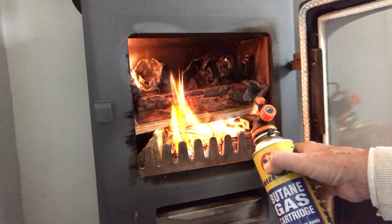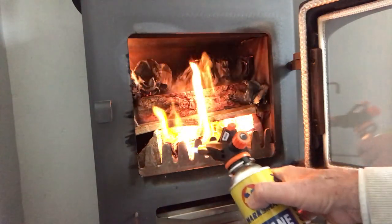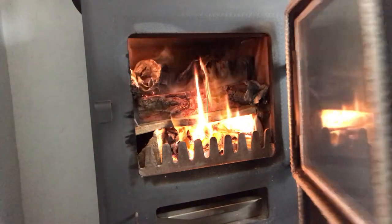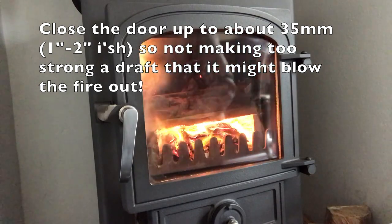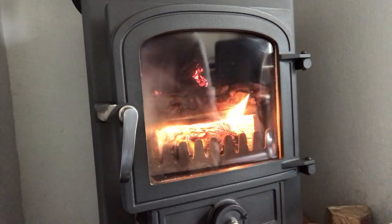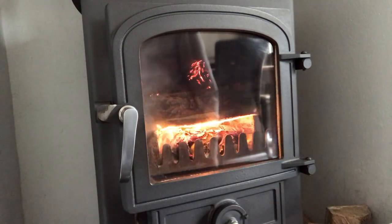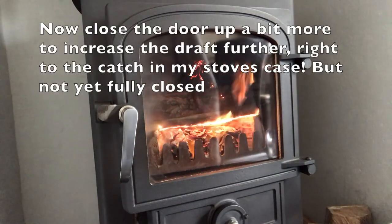I feel quite comfortable now that we've got a good heated chamber and the flue is at a good temperature — the cold air is not going to flood the chamber and put the fire out, and that's what causes the smoke. So this has been a successful lighting; I haven't had the usual problems of a room full of smoke, and it certainly answers the way of preventing it for me.